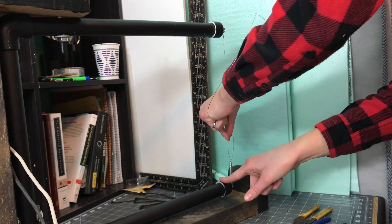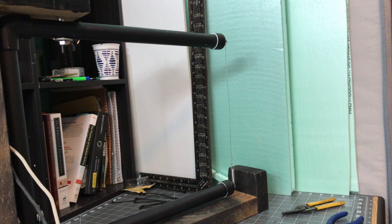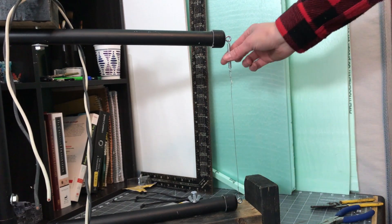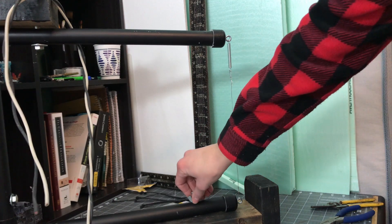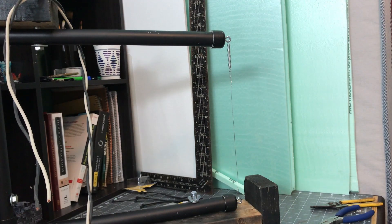When I put the wire onto it and pulled it tight to stretch out the spring a little bit, I noticed that the top pipe really came down and deformed a lot, which makes sense since neither of the elbow joints are super strong. So I ended up putting another bolt on the top, like I did on the bottom, to hold those pipes sturdy. Originally I was going to put the spring on the bottom side, but I switched to putting it on the top because the twisted wire bit would stick up through the table and that wouldn't give a nice clean cut. After I did this, I noticed that I probably could skip the spring and just use these two bolts to provide tension. Then I plugged it in, turned on the switches, and nothing happened.